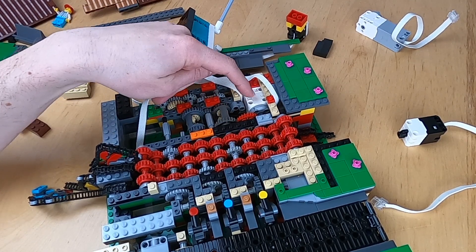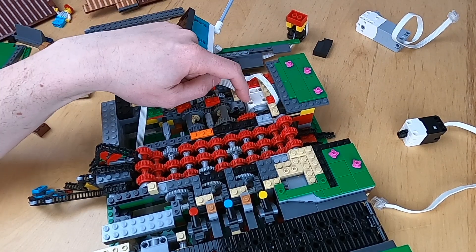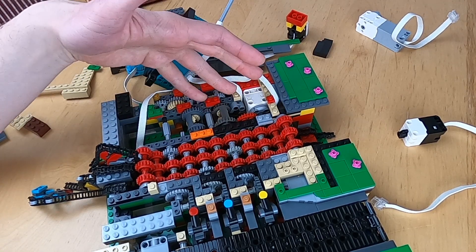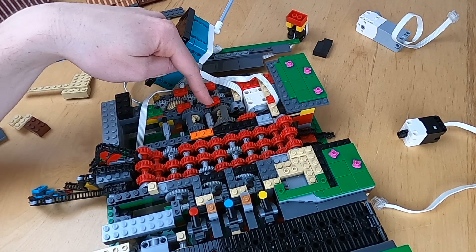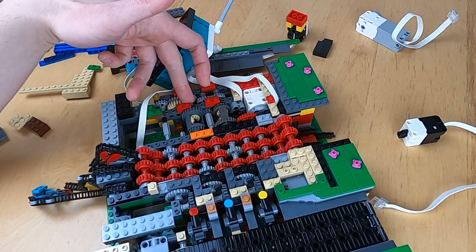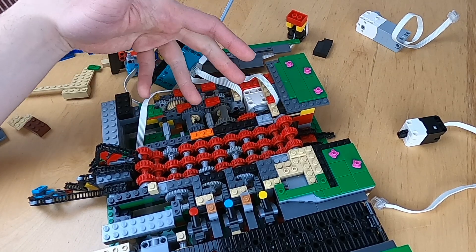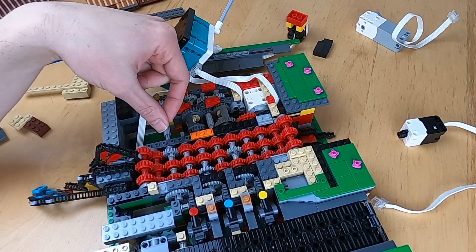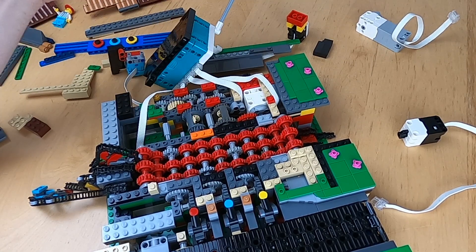For that reason I'm running this motor a bit forward to compensate. Every time there's a push from the trigger, I move this motor forward so the other horses that aren't being pushed forward aren't moved too far backwards. It also means that if no trigger is activated, something is still moving forward — mostly the cyan horse, because the whole mechanism to the cyan horse is really loose, giving it an easy time being pushed. The yellow horse goes directly to one differential and moves nicely, but the red horse needs to go through all the mechanism in the back and has a harder time moving forward — which is why it's the most difficult to win, but also the greatest satisfaction.